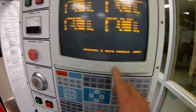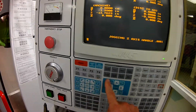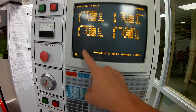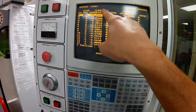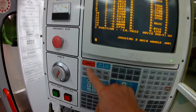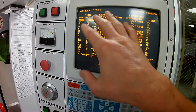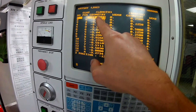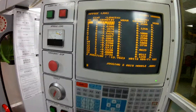As soon as I'm done with that, I go over here to tool offset measure. I need to make sure I'm in the right screen, so I'm going to go to offset. This is my offset, this is my length, my tool number, and then I will do the tool measure. It will update this. I just got done setting this tool, and as you can see it's exactly the same spot because I hit tool offset measure and it didn't change.